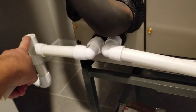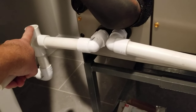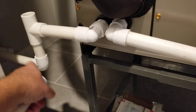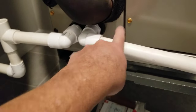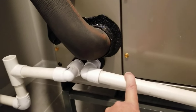I should add two things. If this is backed up, don't put vinegar in there. The reason being is that vinegar is corrosive. And I know you're saying this is only PVC — true. But if it's backed up, that vinegar is going to backflow into the condenser unit. And what's in there? The condenser coils — metal. It will be corrosive.